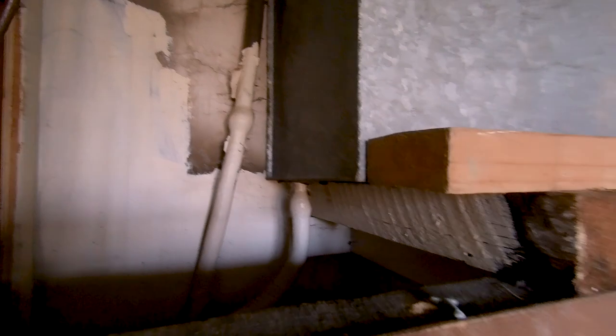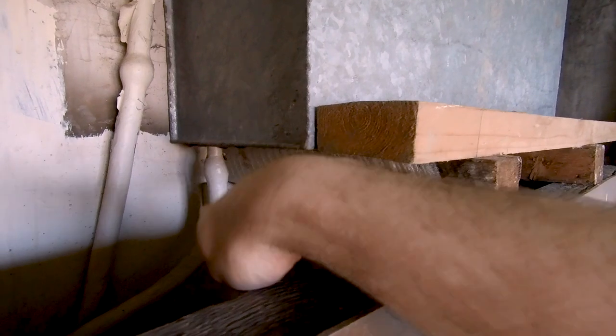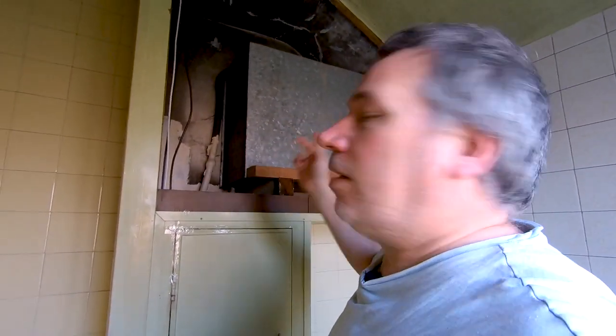Right, first things first, get started. We need to take this tank out, and then we need to take the heater tank out as well. Under here, we've got the pipes that are going to our heating tank. So we're probably going to get an angle grinder and cut that one off. That one up there, I don't know how far that's going in, but that might just lift out of there. And then we've got a couple of pipes down the side where our mains cold water used to come in, and an overflow going to outside. So we'll just start cutting the pipes, stripping this stuff out. So let's go on with this. Time for a time lapse.